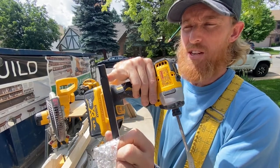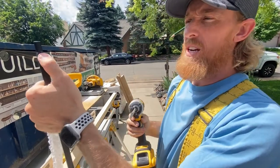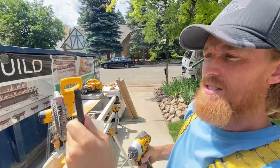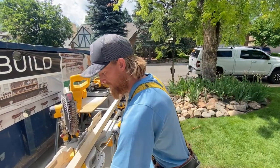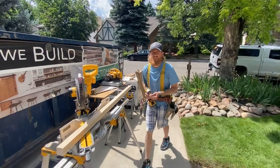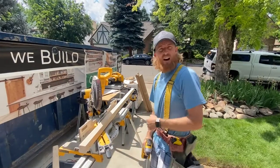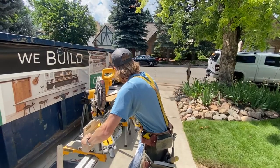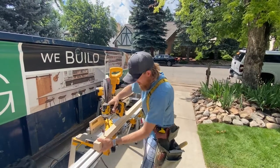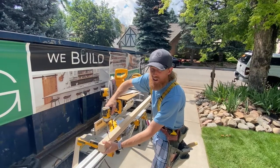So we need to make sure we drill the top handrail. I know we're gonna be drilling down, but we need to make sure we drill roughly an inch in so that entire nub can slide up into the handrail. Okay, half inch paddle bit. Let's just drill these out. Keep it moving. Get the point right on the center of your cross or your mark and start drilling.